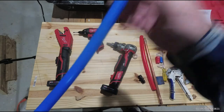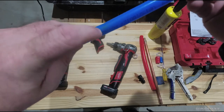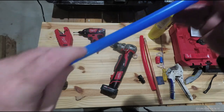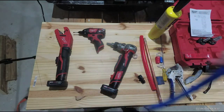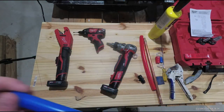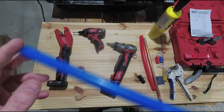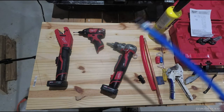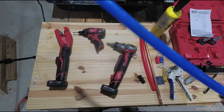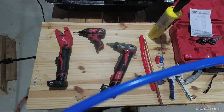I don't recommend it, but it can be done — it can be saved. I've done another one a couple days ago and other than a small burnt spot it's pretty much perfect. I've done it under the house where I accidentally crimped it pulling it through tight spaces — you can bend and crimp it and it can be repaired without replacing the whole length of pipe. I believe it's only the Uponor Pex-A that will get its memory back.